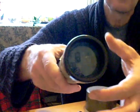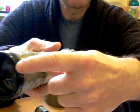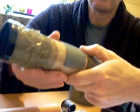If you find an old pair of binoculars, perhaps they're too high powered, or they're just unwieldy and you can't collimate them, that is focus both eyes to commonplace, and you want to use them for astronomy, this is what you do. Use the front lens, unscrew it from the binocular, and it'll come with its own attached part from the binocular. You'll need to provide your own tube.